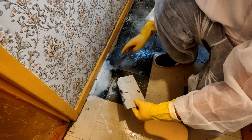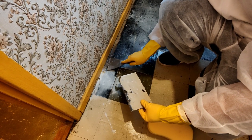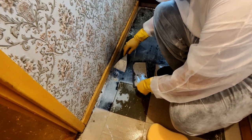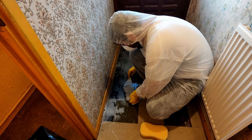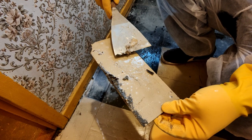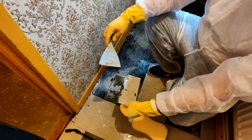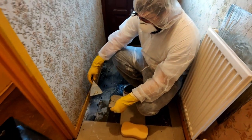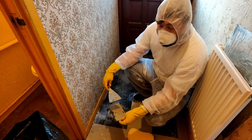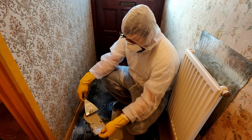I've got a few little chips in there just underneath the skirting here still to come up. Any asbestos fibers, as this dries out from being worked on, are just going to be pumped out through the sides. So it's probably best not to try to sweep this up at first. Glue it all down with the solution, and then if you scrape the glue back it's much less likely that any fibers are going to escape.